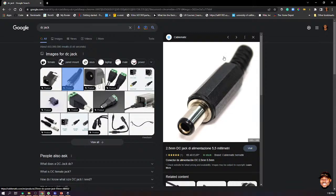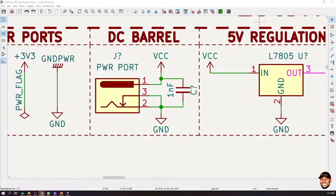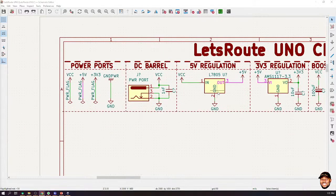However, you realize that whatever the arrangement, it depends on whoever connects the wires, right? That means there is a high probability of something going wrong, that is, the person connecting the negative to the inside and the positive to the outside. These things can happen. I think I've even been a victim of this before, so I understand what I'm saying. So in order to protect our circuit or our system against this, we have to handle something we call reverse polarity, reverse current. Now the question is, how can we handle reverse current?